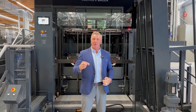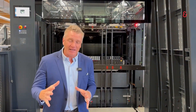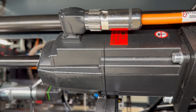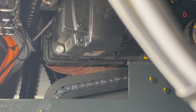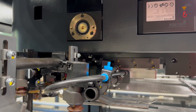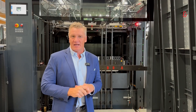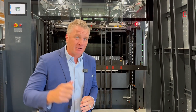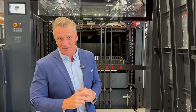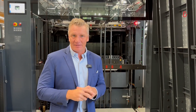We want to talk to you about our Drive Tronic feeder. We have a series of dedicated motors throughout the press, but here at the feeder these motors run the feeder head 100% of the time — we're not connected via belts or gears to the main drive. That's one of the reasons why we're able to get up to speeds of 22,000 sheets an hour on our medium format press, because of these dedicated motors.